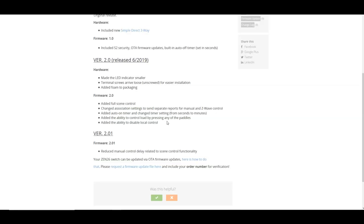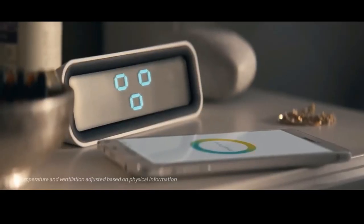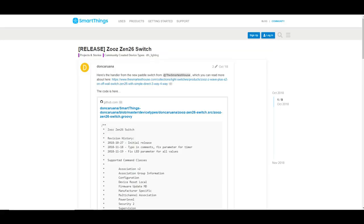There have been some cool new features added. Firmware 2.0 added an auto-on timer and full scene control. The same goes for the Zen 27 — check your firmware version on that as well. Firmware 2.01 added full scene control and double-tap behavior control. On the SmartThings Hub, getting that capability fully working requires a custom device handler — link in the description below. On the Hubitat side, as of when I made this video, there are no custom device handlers yet, but my latest reading says they are working on that.